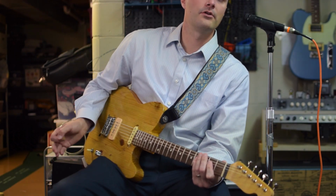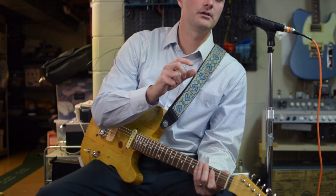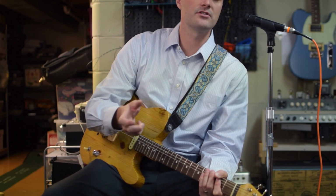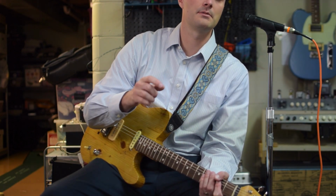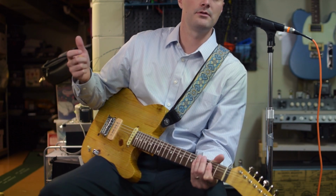Now, I've also got this mid control, and if my memory serves me, the mid control is like 250K, which is massive. Typically, you see mid controls between 10K and 25K. The idea there was that as you add an obscene amount of resistance, it defeats the mid control and it becomes a tone stack bypass. So I think that's maybe part of what's happening, and I probably need to mess around with that mid range value. If I turn the mid range down to low, let's sweep the bass and treble again.